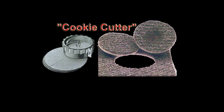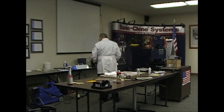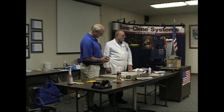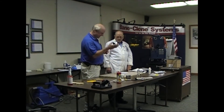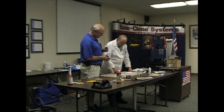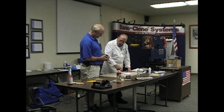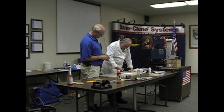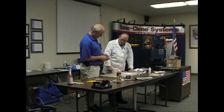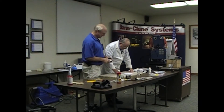This is a good time to talk about the cookie cutter. Since you could claim to be an expert at this, our primary objective is that what we're going to replace with must exactly match. Not all spots are going to be this big — they may be smaller or bigger — but it's a good general-purpose approach. As an installer, he knows right away what the pile direction is, and pile direction is crucial.